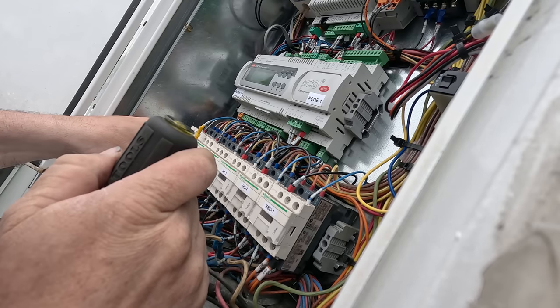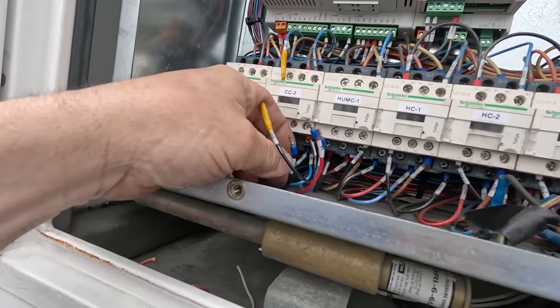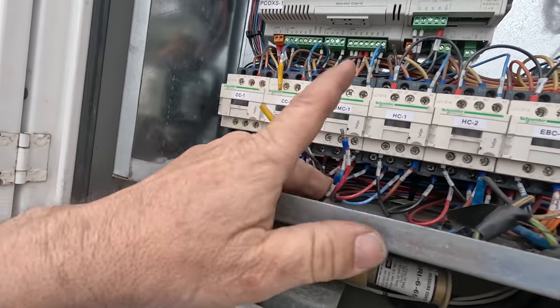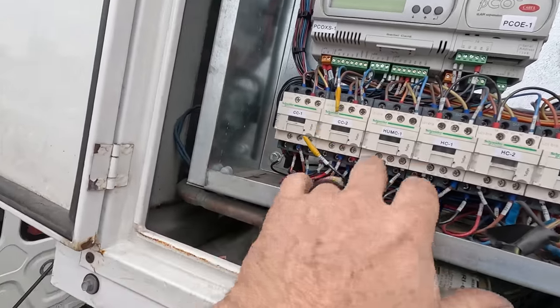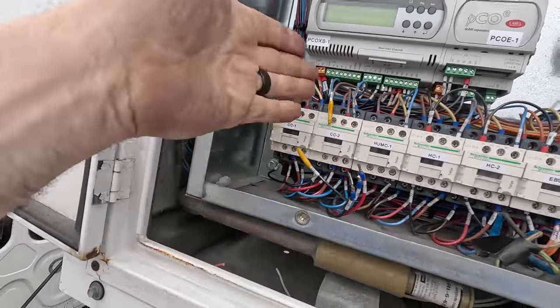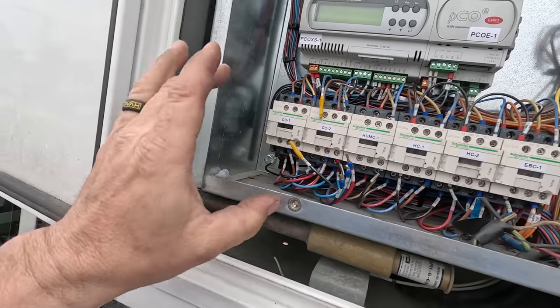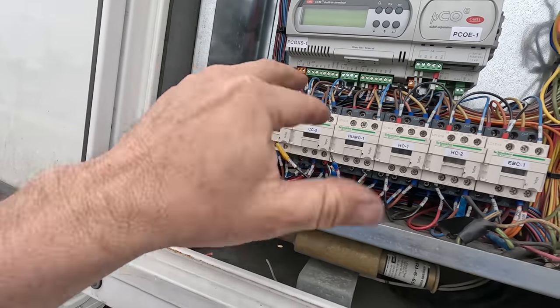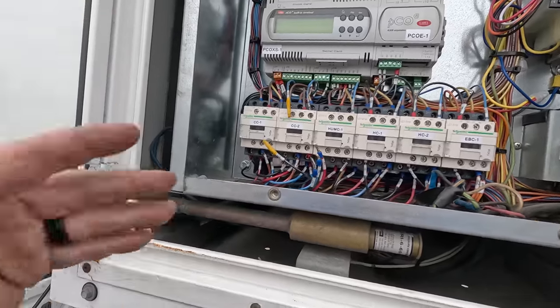I am going to speculate that they're both the same tonnage. So we still have the number two, the true number two contactor compressor unhooked. We just moved it over to here. Both contactors, I mean, if it works, I will switch the contactor so that first stage is always the one that kind of goes first. I'm assuming that's how it works.